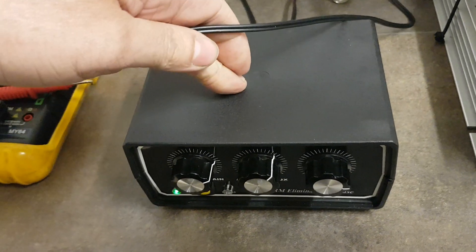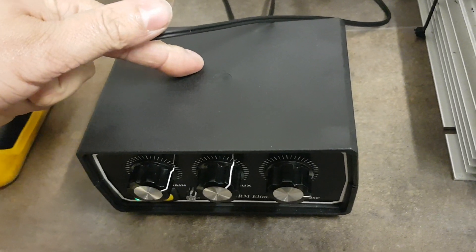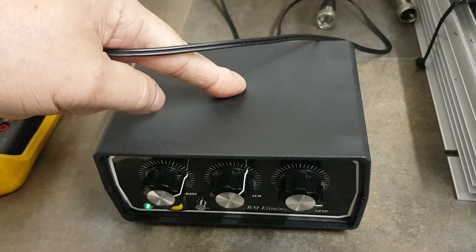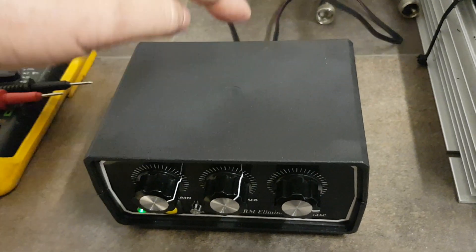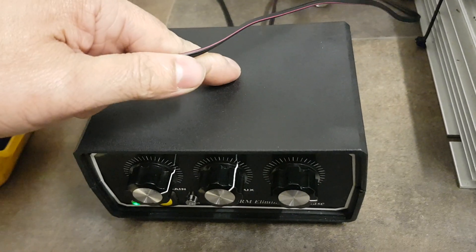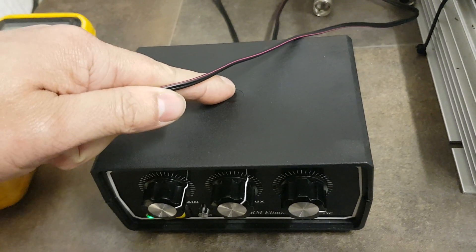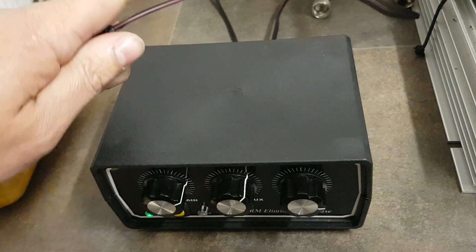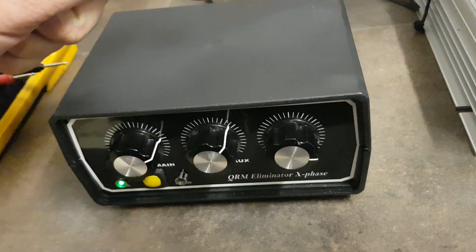Can I plug this to any radio? Yes. Things I found out while testing it: the impedance seems to be different from 50 ohms. When I plug it to my antenna and transmit with the radio, if I put an SWR meter inline — if I was at 1:1 on one channel — I become 1.2. So be aware of that.